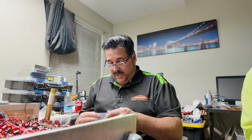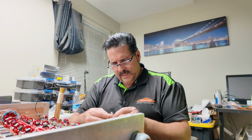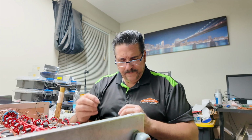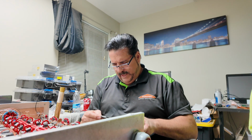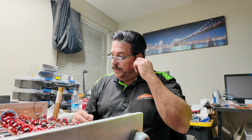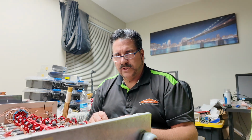This box, as you might know from the other videos, is a rebuild from another box. Completely stripped down. It's not the same box anymore. We're reusing the pills, which is kind of a no-no, but we had to try it, and it generally works. A few of them we had to change because they weren't matched correctly. This 32 pill box takes twice as long to rebuild as it would to build a new one. But it was kind of a challenge.